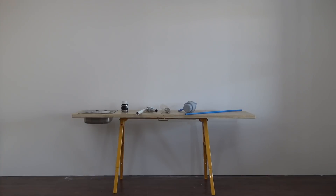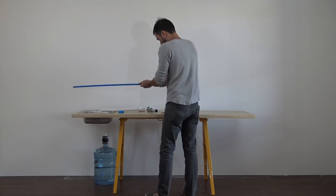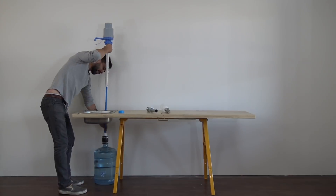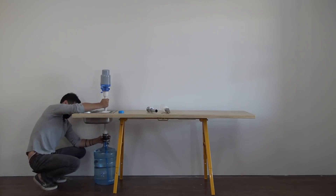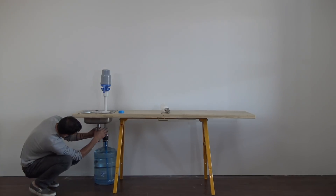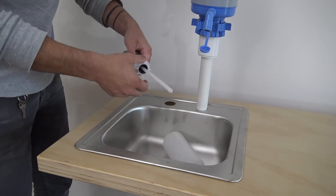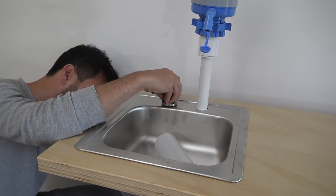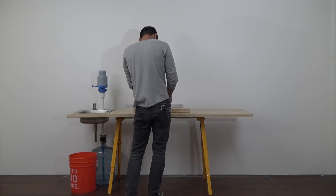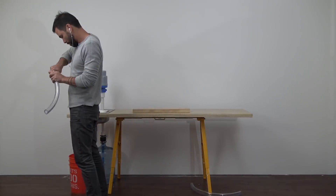I can now just place the jug underneath the sink and insert the PVC pipe with the PEX pipe in it right through the sink hole and into the jug, where it's tightened on with the rubber coupling and hose clamps. I got a vanity sink drain from Home Depot and screwed that right into the sink. I thought a soap dispenser would be a great idea for the other hole in the sink, since when you're out camping it's nice to have Purell on hand. The drain wasn't quite long enough to safely get water into the bucket, so I added a short piece of vinyl hose.